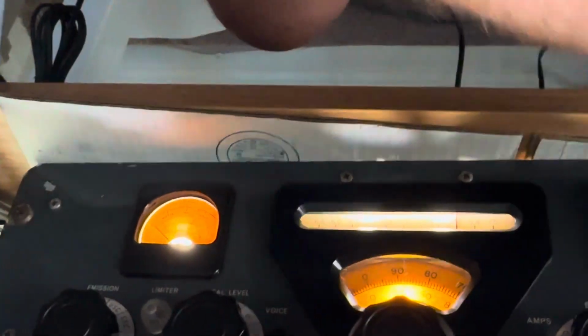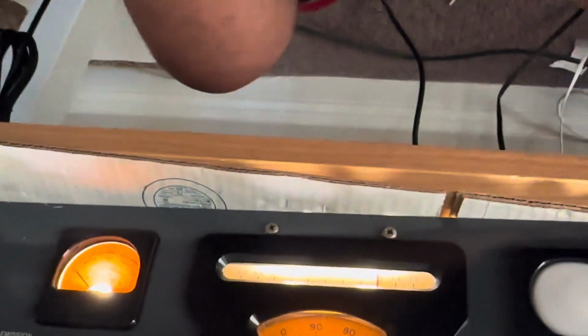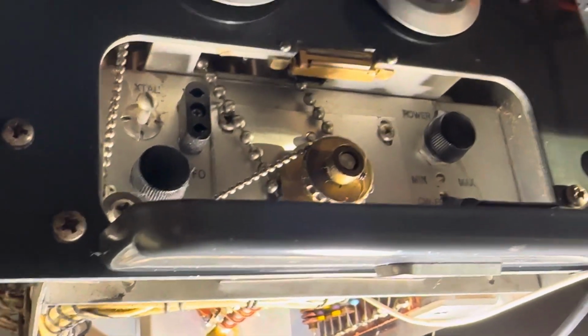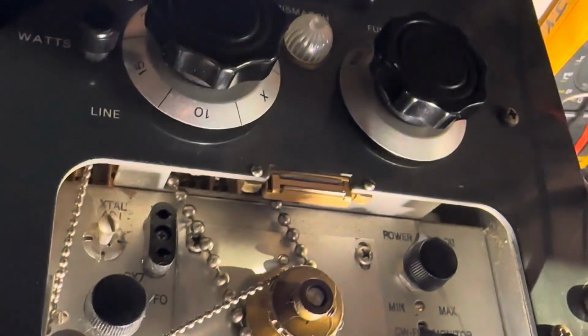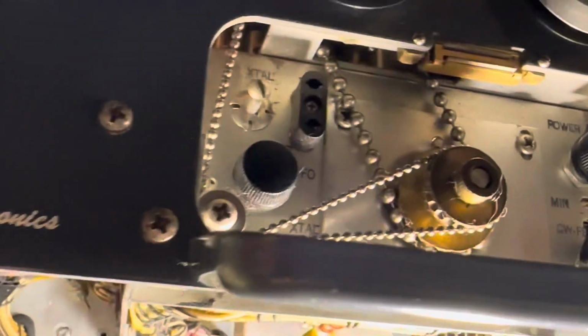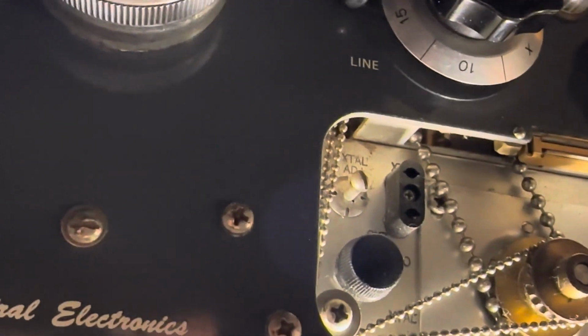Unfortunately, I'm still running on the Variac. I can't seem to get the power levels right on this thing. Let me show you what I mean about the power supply. So let me unkey there, and let's get this meter unplugged from that bias reading and not shock something, and let me ground the meter. It's grounded. Okay, so now we're ready for measuring. So let's show you the B+.